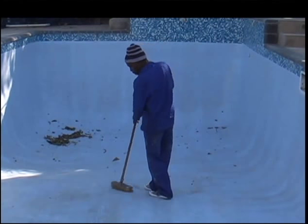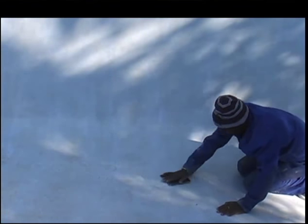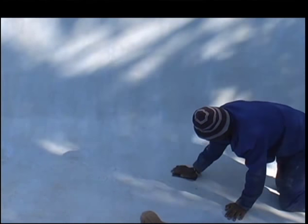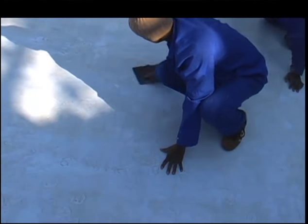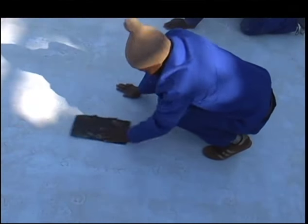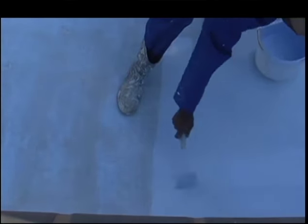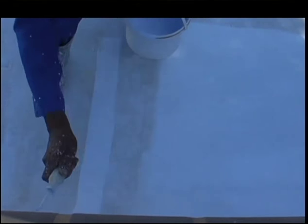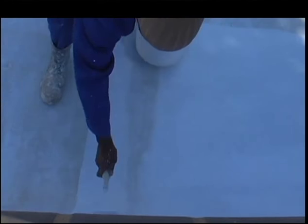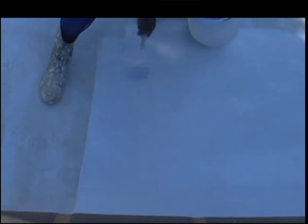That is the next day. The coating is now hard and set — a little bit glossy, still patchy. We can clean that now if there are leaves or rainwater in the pool, and then start sanding the whole surface. Using 60 grit sandpaper to break the gloss — just scratch it a bit to create a good mechanical bond for the next layer. This is the longer process where we left the coating to dry overnight, sanded it, and then proceeded with the next top coat layer. You will now see how the color starts to come out very solid. You can apply more thickly now on this sanded layer. Be careful for tear drops. And there is the finished result after the second coat.